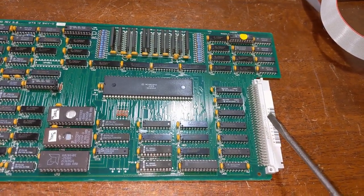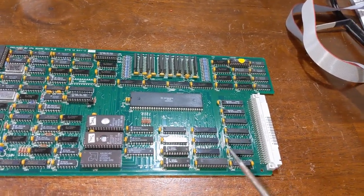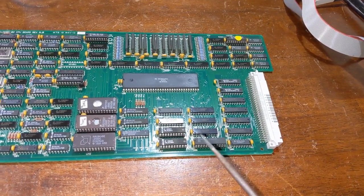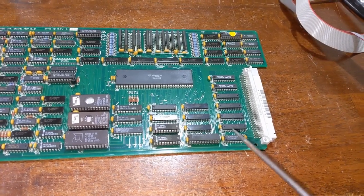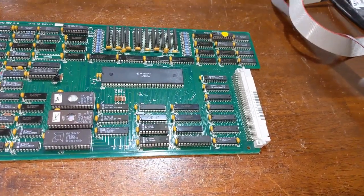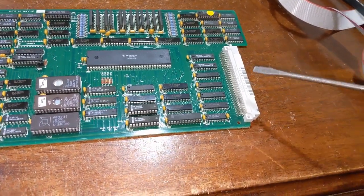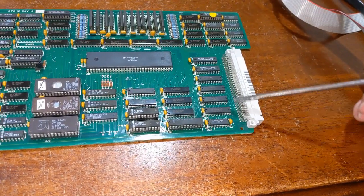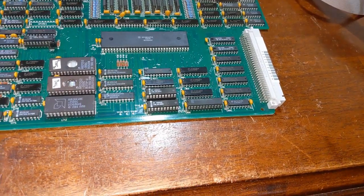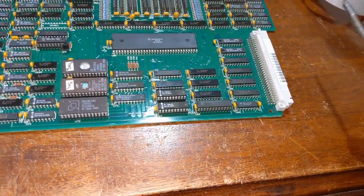with a twist. Here's why I say it was a twist. Because the Weather Channel, Applied Micro Science, or Applied Micro Technology, whoever engineered it, and then Northern Telecom manufactured it, decided to take the existing VME bus architecture and then they modified it a little bit. So it's not pin compatible with the VME bus, but the bus grant request lines, address and data lines follow the VME standard. But the IRQ lines have changed and they moved things around because they added some additional voltages in here that are not part of the VME bus standard. So you got to watch out for that. So you can't take a VME bus card and put it in here for diagnostics. You're just going to blow stuff up. So you can't do that.